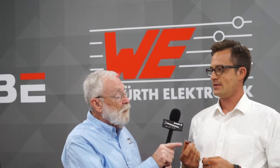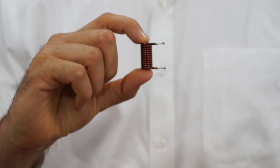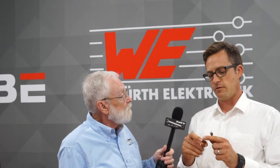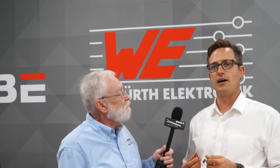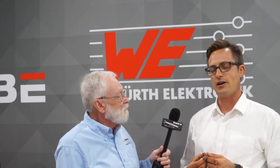What is the failure mode on something like that? These are pretty simple, which is a good thing. It's basically a piece of magnet wire wrapped around a ferrite core with an adhesive applied to it, and then the pins are tinned and placed into the modules. As you can see in other parts of the booth, they're doing all the normal automotive qualifications to make sure these things last as long as the vehicle does, or longer.